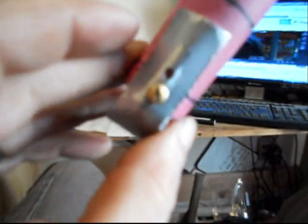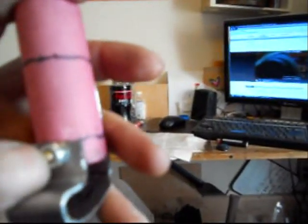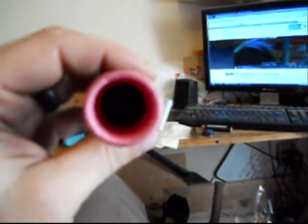Okay, so here we got the foot bolted through. I used just a brass bolt, 6-32 bolt. Went with a nickel plate nylon lock nut so it won't back off, because as the dog walks, it's going to bounce and vibrate, and just a standard washer I didn't think was going to hold up to that. Cut the excess bolt off, filed down any sharp edges, gently peened it over with a hammer. Then inside here, you can see that black spot, which wasn't there before. That is roughly a quarter-sized chunk of padding, and the padding is cut from this material here.